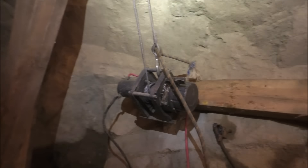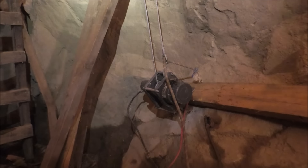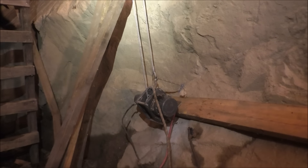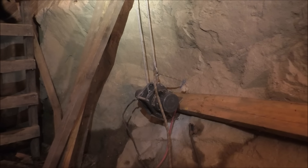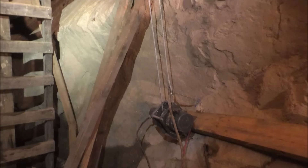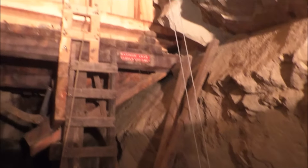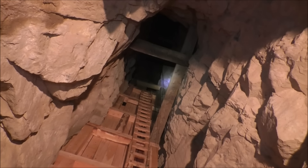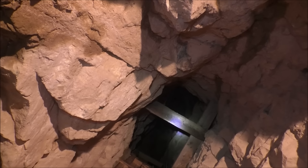A lot of people say you should just hook up a hoist or a winch and lower yourself down the shaft. Never do that — they're not safe, they're not designed for that. If you're pulling a stump out and it slips, no big deal. But if it lets go when you're going down somewhere, it'll kill you. We've had that happen where boards have gone up and all of a sudden it wasn't engaged properly and came back down. You can't trust them. They're not made for that. You should never use stuff for hoisting that is not certified and designed for that purpose.